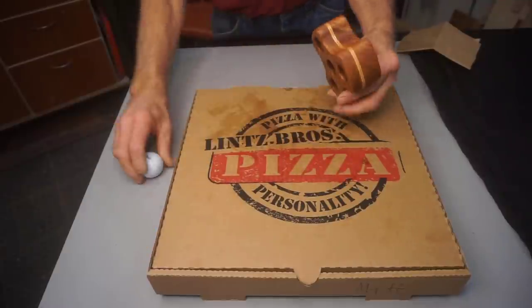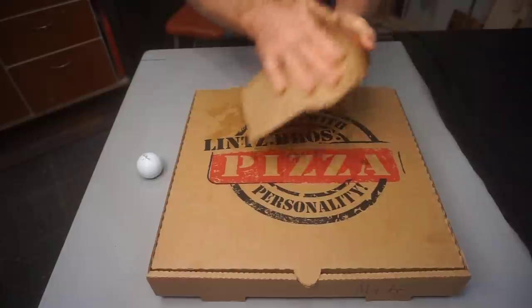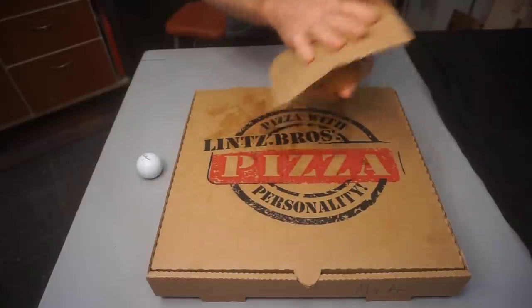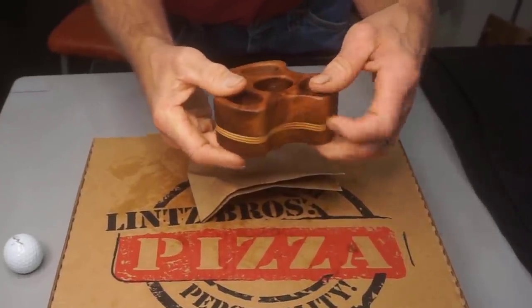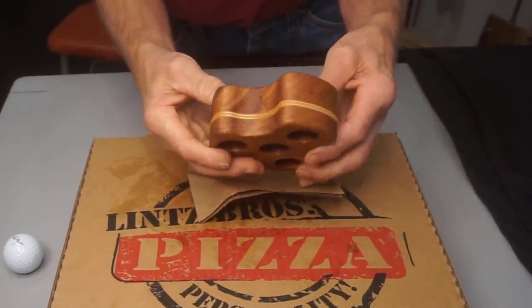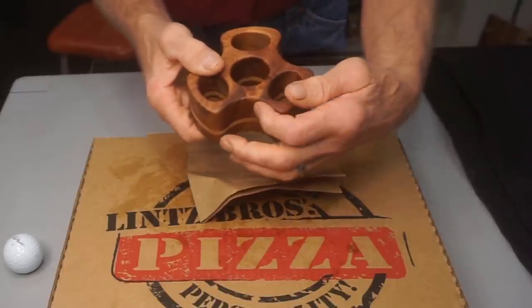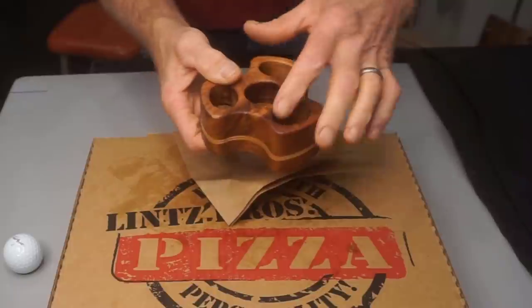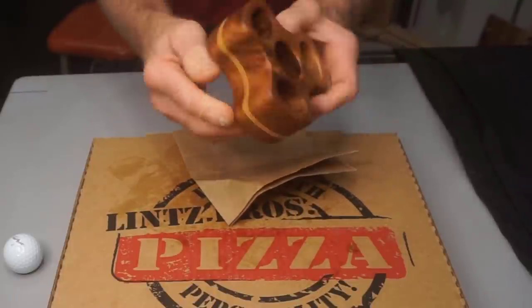Once the Old Master's gel poly has had a couple hours to dry, I buff it with a piece of brown paper bag to even out the sheen of the varnish. Now that the varnish is dry and buffed a little bit, those repaired chips are, as I said, invisible. And I like the way this little bit of grain next to that fissure in the blank ended up in the finished block to give visual interest to the caddy.